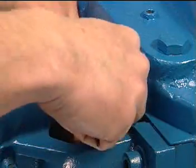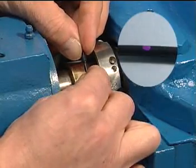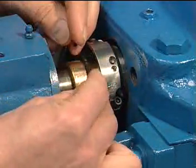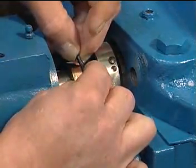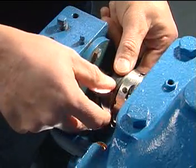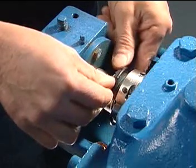Affix the rotary O-ring around the shaft — this is the O-ring with the purple dot for identification. Then affix the stationary O-ring around the shaft, placing it on the outboard side of the rotary O-ring. Carefully nest the two stationary face halves around the shaft between the O-rings. Slide the stationary O-ring over the back of the stationary face.